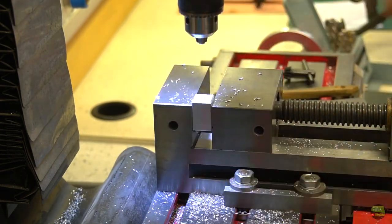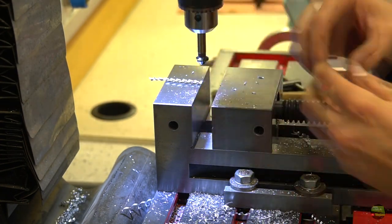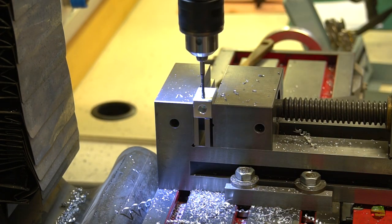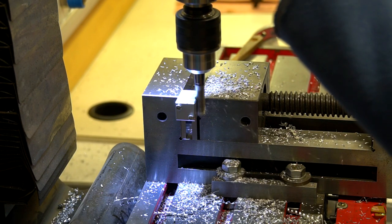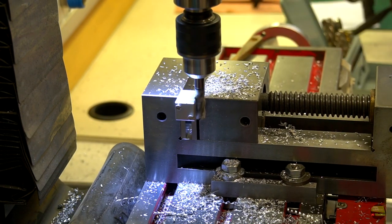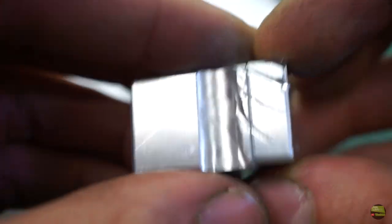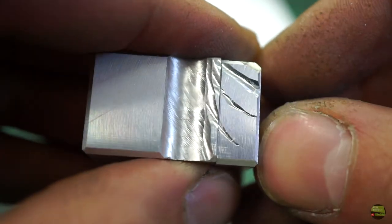Then I drill a hole into the center to mount the shaft — I use a 10 mm drill bit but it depends on the shaft dimension. I already have the center set so this is a good moment to drill and cut the thread for blocking the shaft. Then I tried to cut two grooves from both sides for better grip and look, but it didn't end well. It's totally my fault because I clamped it wrong and chose the wrong tool. But at least the mill stayed untouched. The part is still totally usable — I need the seal more than a perfect circle cutter, so I won't make a new part. But now I've got more parts, so it can be mounted in another position.